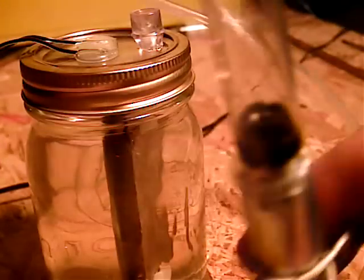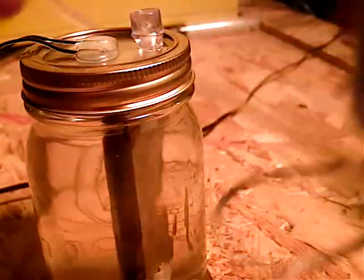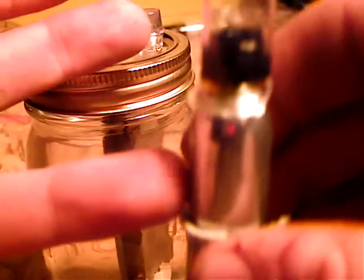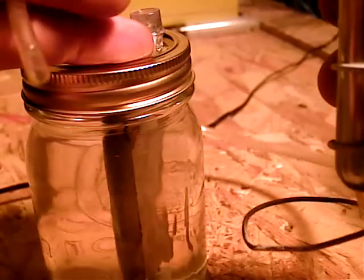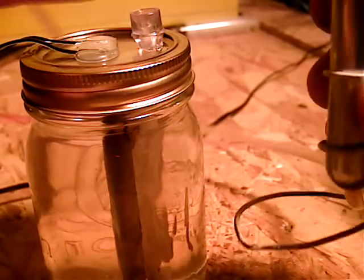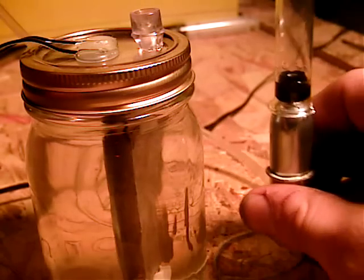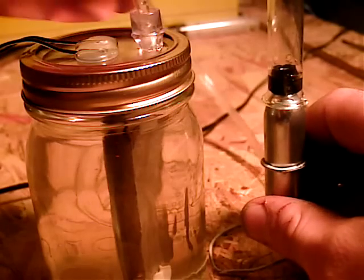It's a CO2 cartridge, rubber grommet, and a glass tube. The glass tube is only there so you can actually hopefully see the flame. I've got water inside of this, about halfway, and that creates a valve. So in the event that the flame would happen to go through the tube, it can't get back to the cartridge. That's why we put the water — it acts like a check valve.